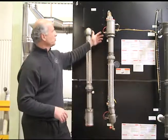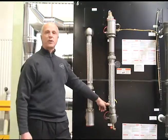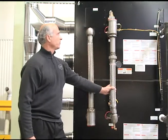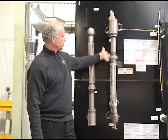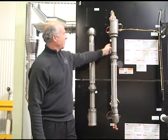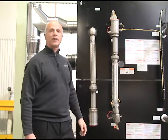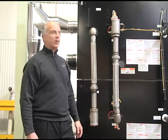We can stage the boilers accordingly to match the temperature requirement and overall demand of the system at any point in time. On the manifolds you'll notice we have our safeties — our flow switches which monitor the flow rate through each block to make sure we have appropriate flow and activation. While the unit is in operation we have our pressure and temperature relief valves on each boiler independently. We have our high limit with manual reset, all pre-wired in, and drains off of the manifold in case you need to do any servicing or draining or chemical cleaning long term.